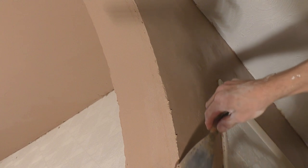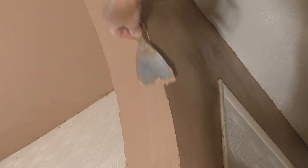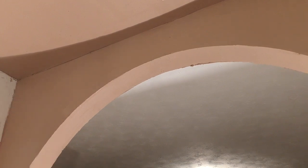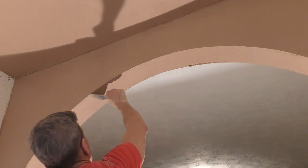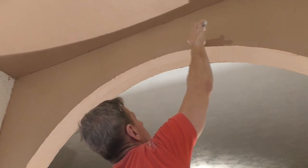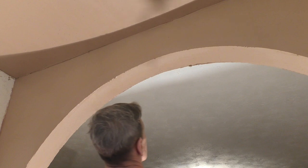That's not too bad. Now I'm putting some water on the edge here and using my filling knife cum scraper to just form a bit of a nicer edge to that arch. You need a fair bit of water to make sure the two parts blend in quite nicely. Then you take this all the way around - don't over-play with it otherwise you'll start to damage the edge. It's a very gentle pass over with that scraping knife, not putting any great pressure on it, just very gently to the side and underneath, keeping it wet - otherwise if it starts to drag badly it'll really mess up your edge.